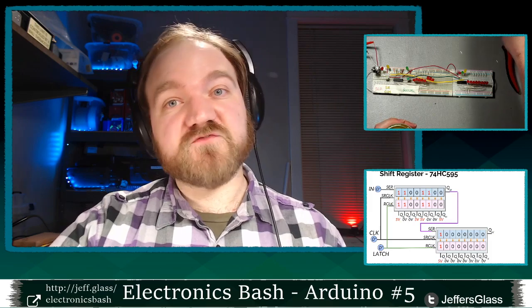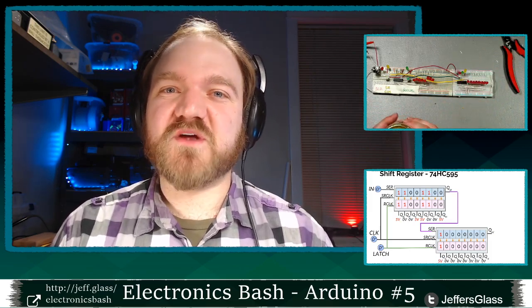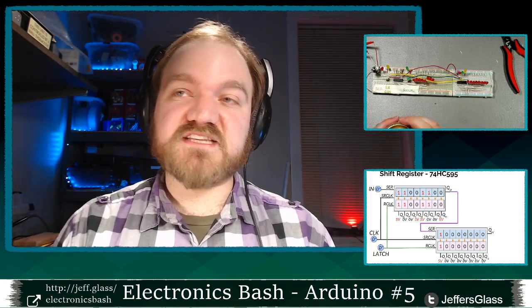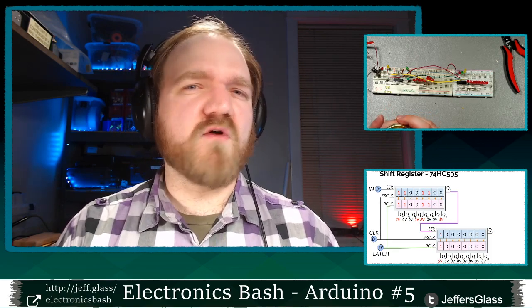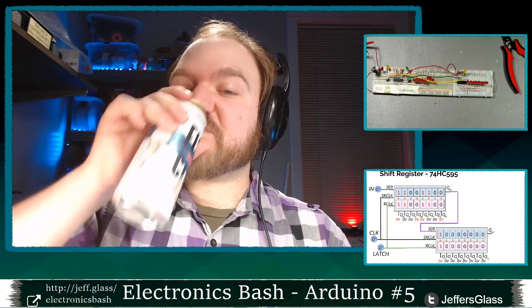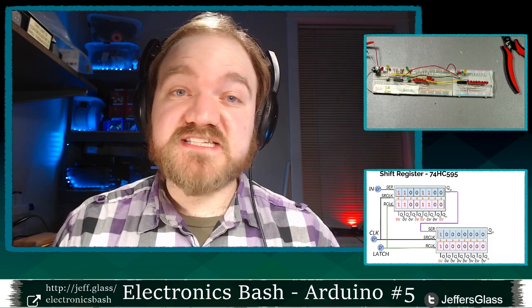You could make use of a shift register and 8 digital pins, right? If we need 16 outputs, we do a shift register for 8 of those pins and 8 digital outputs for the other 8. They might need transistors on those 8 digital pins depending on how much power you're pushing out, but that's totally doable. Ah, Kenneth's got it. Yeah, you need 8 plus 3 instead of just 3, but still totally doable.